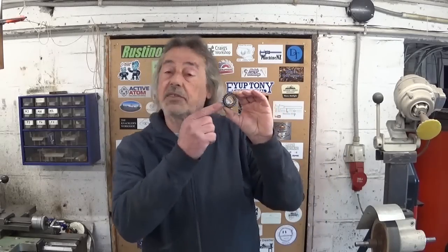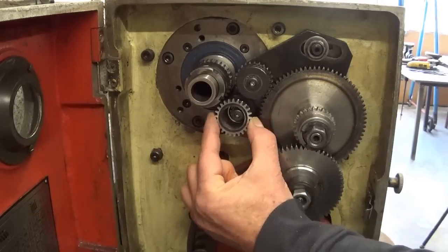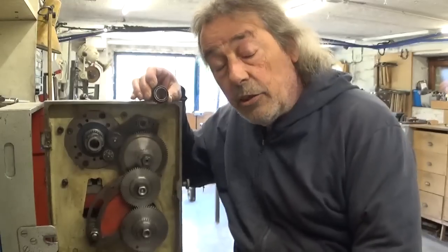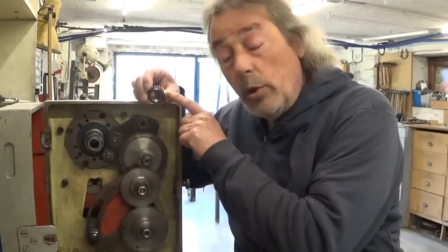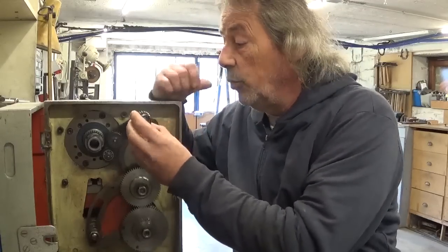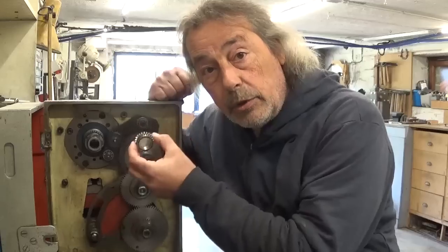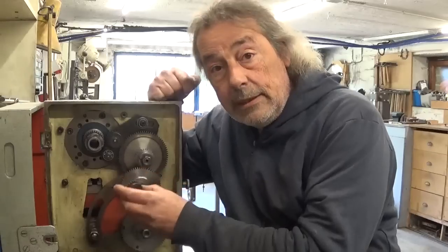I have here a cute little gear. This little gear is part of the gear train of the lathe — this one is the idler, and it comes right here. I think a previous owner of this machine installed it the wrong way, and that's why it is completely chewed up. When it spins it makes terrible rattling noises, and the ball bearings are completely cooked.